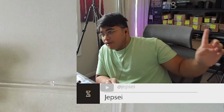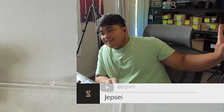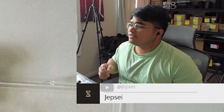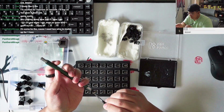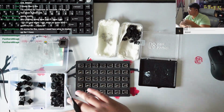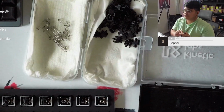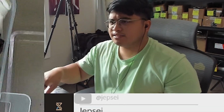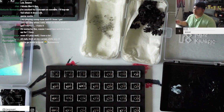And you can see I have a problem. These are all keyboards, and so are all the... So I have a lot of content to catch up on. I think I have this little 35 batch of switches left, and then a couple more. These are vintage MX Blacks, harvested from keyboards in 1993, I think. And so what I'm doing is lube filming and spring swapping.